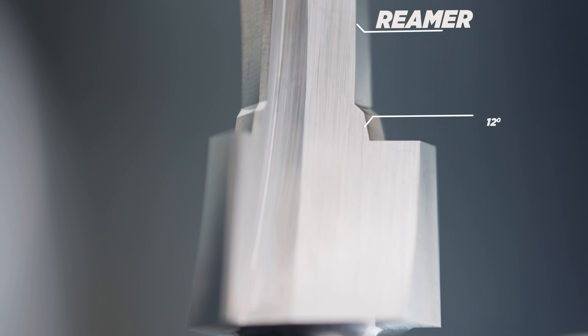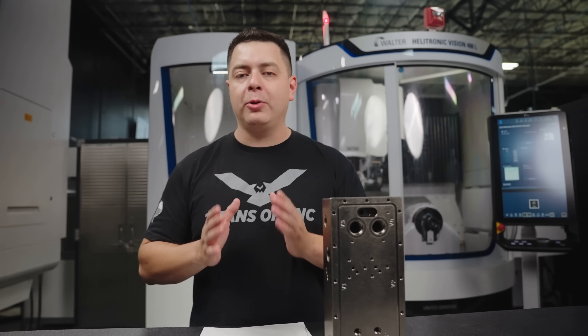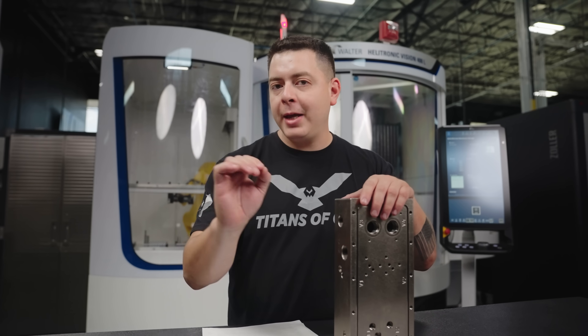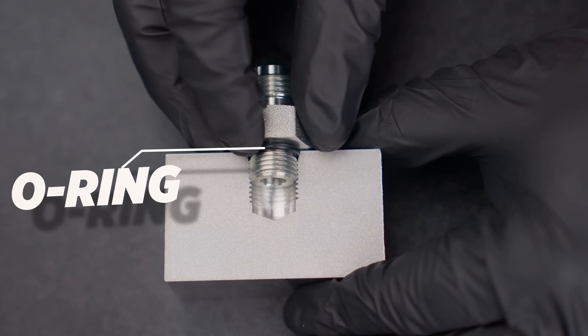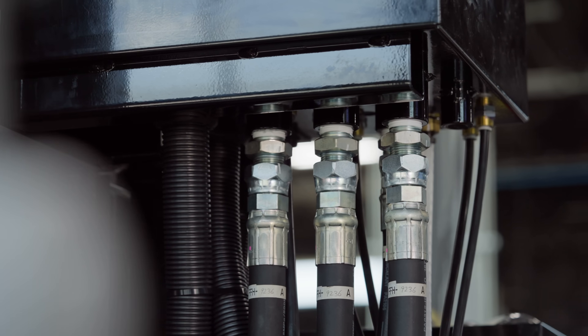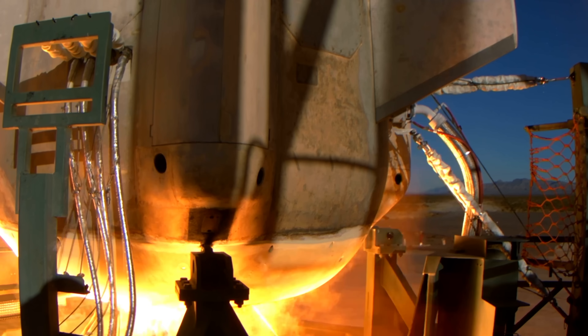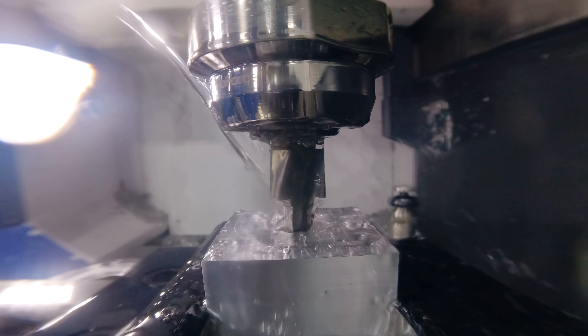What makes it cool is all the different crazy angles: you have a taper, a reamer, a 12-degree, a 45-degree, and then a spot face. We're going to talk about all of those while we're actually grinding the part and what purpose they serve. The main thing to know is that the O-ring on this surface has to fit perfectly. Stick around and I'll show you different applications of what this porting tool is used for, and after grinding it we'll put it in a mill and make some chips.